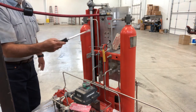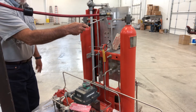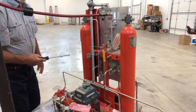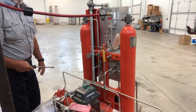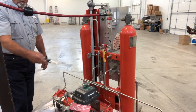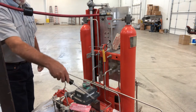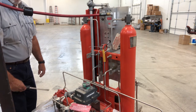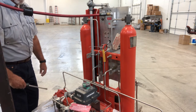As you can tell by our connection, this is the inlet supply gas point. That's pretty well the back end of the actuator — all set up, all pre-wired, everything. The only thing electrically you have to do is come into the position box to wire for both solenoids and the position switches.